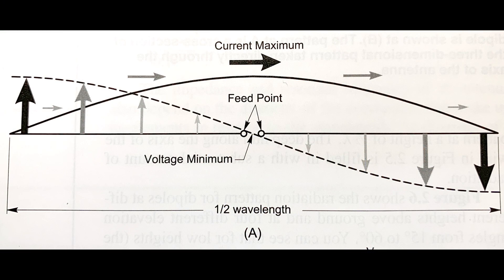One of the most common and ubiquitous antennas for amateur radio is the simple dipole antenna, and for good reason. Dipole antennas are easy to build and are proven performers. The ARRL Antenna Book says the dipole is a fundamental form of antenna. In its most common form, it is approximately one half-wavelength long at the frequency of use. The name comes from 'di', meaning two, and 'pole', meaning part, relating to the opposite voltages applied to each half of the antenna, so that it has two electrical halves.